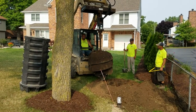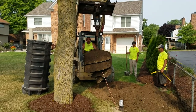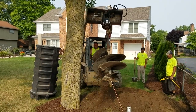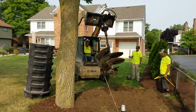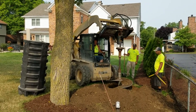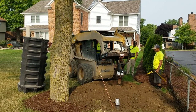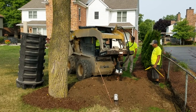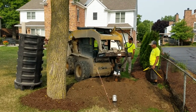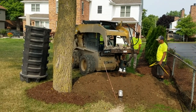A lot of people ask us how we set a five-foot sump pump basin — it's five foot deep. We use a 36-inch auger with extensions, put it on a machine that has the horsepower to twist an auger that size, and we can pretty much get that basin in in three minutes. This is how you install an outdoor sump pump basin that's deep — here in Michigan — in three minutes.